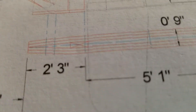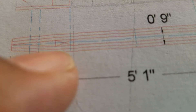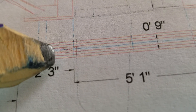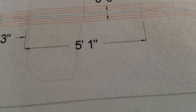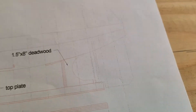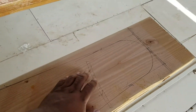What you saw me cutting the other day with those curve joints — those are the first two beams that go around that post down. So that X marks the post down, and those first two lines are the beams I cut the curve joint for. In this high aspect ratio design, it goes from six inches to nine inches wide, runs for nine inches for a bit, and then tapers back down to six inches. It has a constant camber and a constant taper from the forward end.